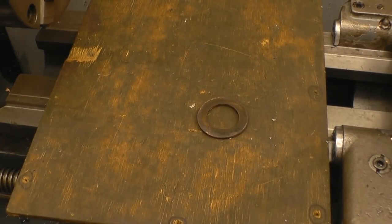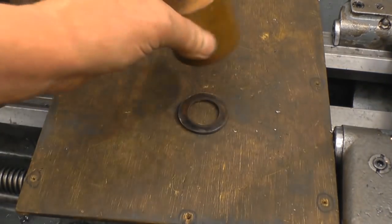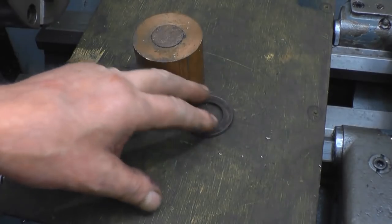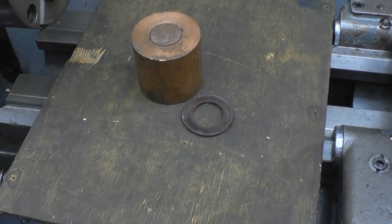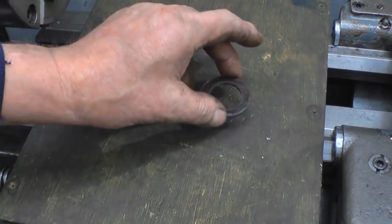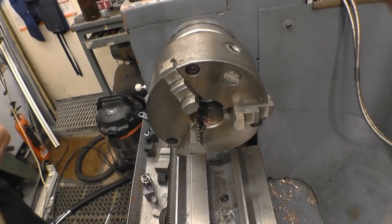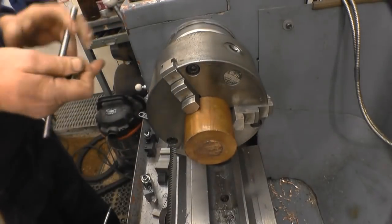I've got one or two little jobs to do for Richard's steam wagon. The first one is I need to make a couple of copper washers. I've got a nice piece of copper round bar to get them out of. These ones I think I made out of flat plate — I had a hell of a job cutting them out. Next time I've got the furnace working, I'll cast some copper bar specifically for making these washers. The copper's not very pleasant stuff to machine — it's very stretchy and chewy, and you need really sharp tooling.